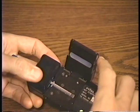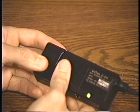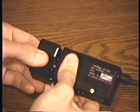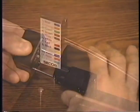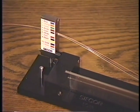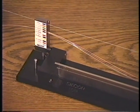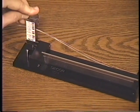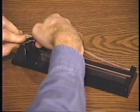When closing the flap, push firmly to bite through the matrix. By adjusting the amount of time you hold down the flap, you can improve the stripping. Test both longer and shorter hold down durations. When working with ribbonized fibers, the ribbon must be straight and smooth, with no rough edges or crossovers. Anything other than a perfect ribbon will be extremely difficult to handle.